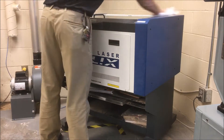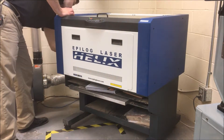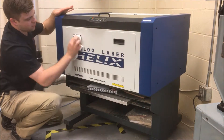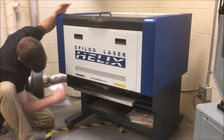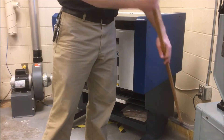Finally, give the outside of the machine a good wipe-down. Sweep for dust and debris in the area around your laser. Any dust and debris that is allowed to build up in, on, or around your laser can create a fire hazard, so take the time to keep your laser clean. You'll get higher quality jobs from your machine, and using it will be more enjoyable.